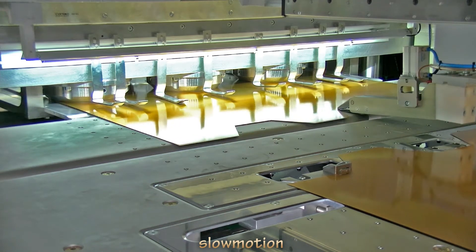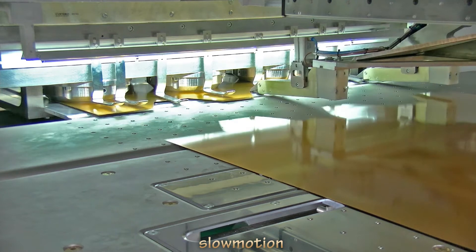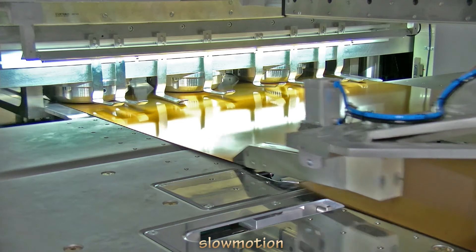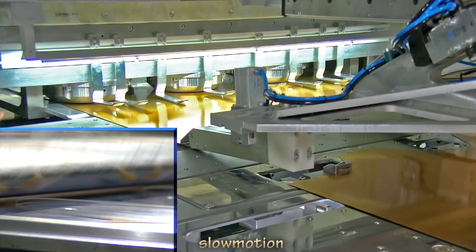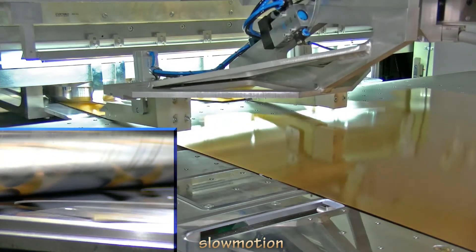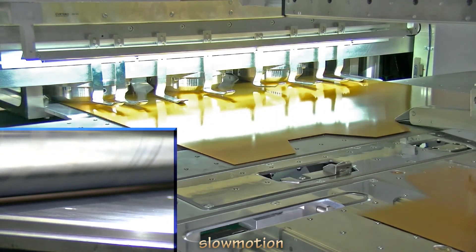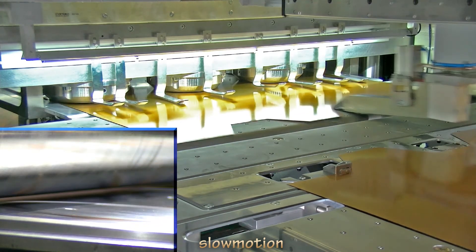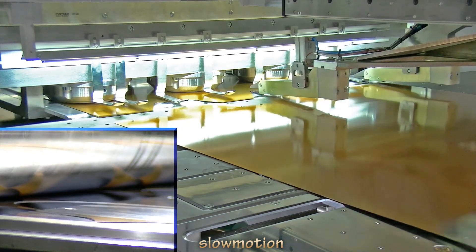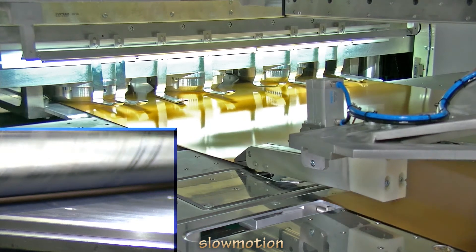The rear side of the sheet is lifted up to enable the grippers to clamp the sheet. When the stamping process reaches the last but one row, the grippers release the sheet and the next sheet is fed close to the tooling. Before the grippers release the sheet, the draw-out rollers are closed to take over sheet feeding and ejection of the scrap skeleton. The arrangement of the gripping tongs allows the 2 feeding systems to pass each other and enables the press to run without idle stroke.